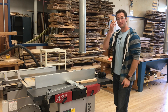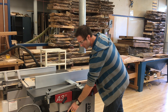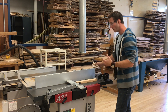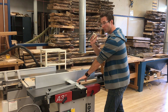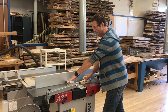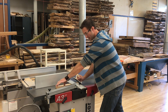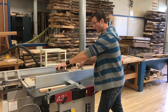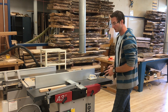Sleeves rolled up, safety glasses on, earmuffs on. With this particular machine, hold down the on button until the machine comes up to full RPM. When passing the board through, I put pressure on the front of the board with my hand and use a push pad on the back. I bridge my hand over the guard with my fingers, lift up with my thumb keeping even pressure the whole time, rocking my push pad up at the back, then grabbing on the other side and keeping that balance and even pressure all the way through.